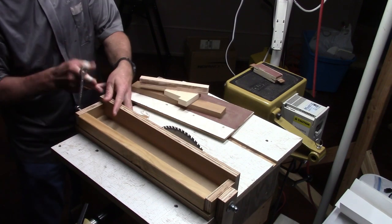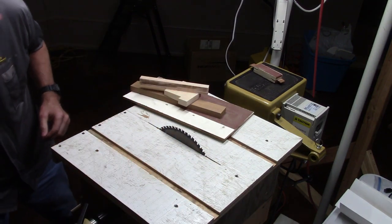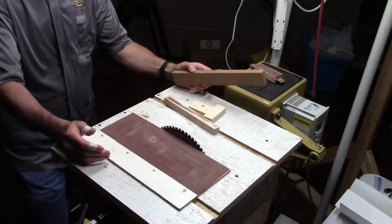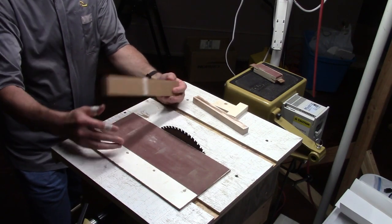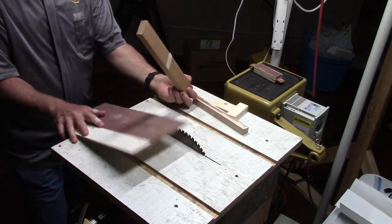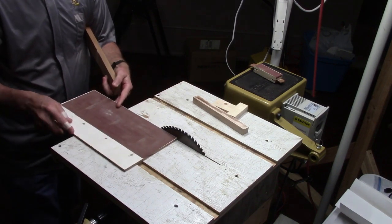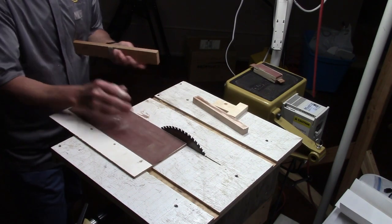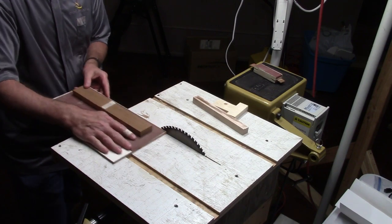if I have a seriously crooked piece of wood, there are all kinds of jigs you can find on the internet. And I typically work with small pieces of wood. I built a sled, and a runner underneath that rides in this slot, and it's not that tight. I have sandpaper on here, which just keeps the wood from sliding down.